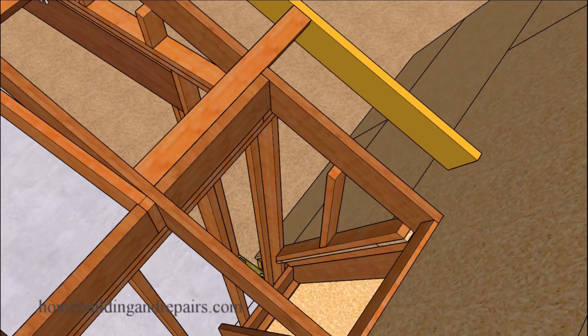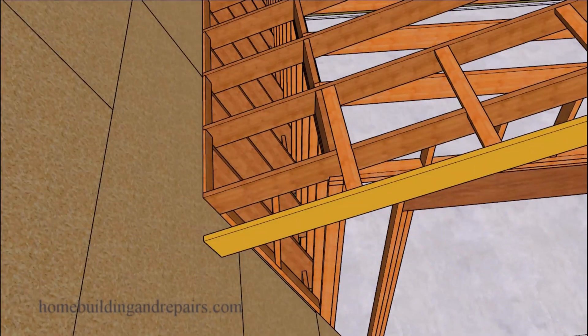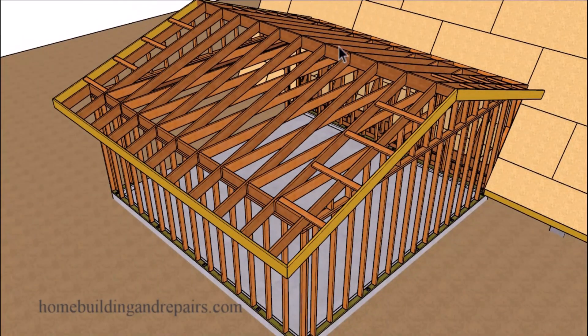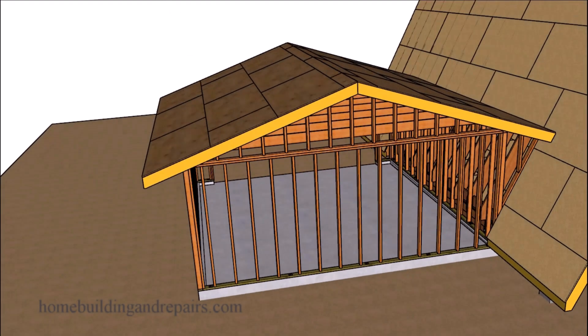Let's go ahead and install our lookouts and fascia board. You might need a larger gap between the fascia board and the roof sheathing depending on how you're going to finish the roofing. We could move these blocks over a little if we want more nailing to attach the roof sheathing, and you could always put a block here depending on how this area is finished with roofing materials. From the back, you can see where it wouldn't be difficult to put a door in either location if you wanted a door going into the backyard.